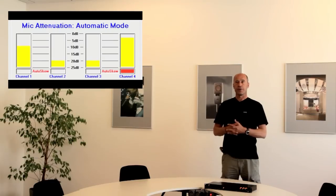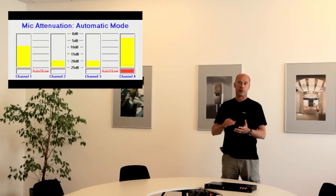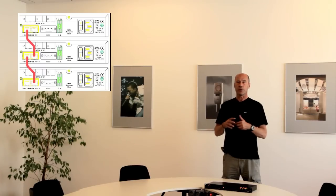If two or more receive a relevant signal, all those channels are prioritized, but in total we still have that 100%. This way you will never run into feedback troubles, and that's the best feedback elimination system you will ever have in your hands. The gain before feedback rises with the number of open microphones that you are using. Since you can cascade up to 10 DMMs, the maximum system size you can have is 120 microphones, all watching each other, all mixed under gain sharing conditions.